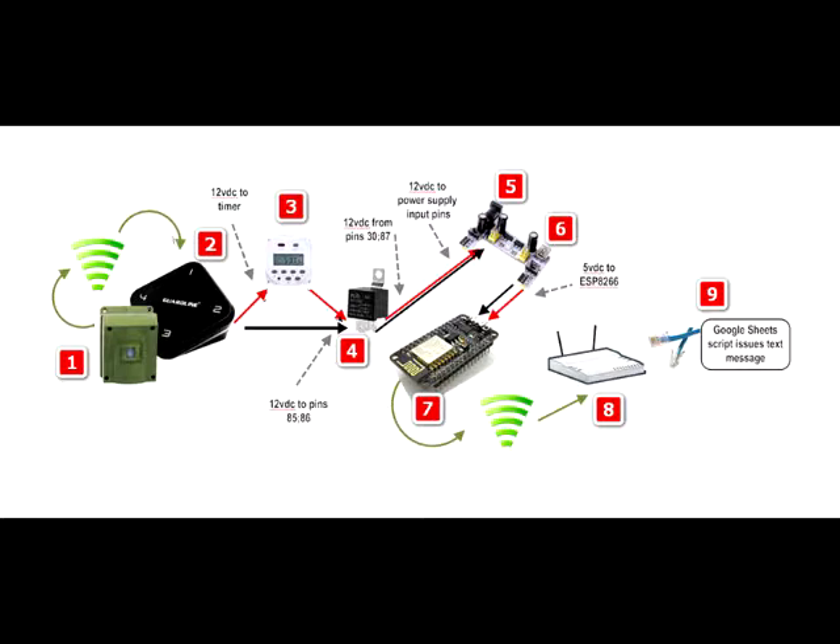At 6, which powers up the ESP8266 at 7. Here it's important to understand how the ESP8266 functions. Whenever power is supplied to it, it's like booting it up. It will run the program it's been flashed with. The ESP8266 will connect to my router with a request to Google Drive. Google Drive will execute the script that's been identified by the Google Script ID defined in the ESP8266 code.